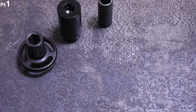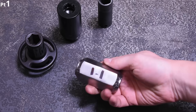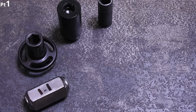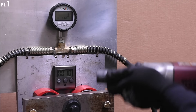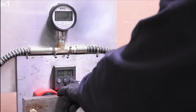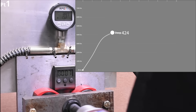Our first homebrew socket, welded together by our friend Ryan, is a long one-inch hex nut that fits over a deep 19mm socket. This costs $6.31 in materials, so it would be a pretty cheap way to hack your impact wrench. Let's see first how a deep impact socket does. Keep in mind this dyno is not calibrated for these dual-size concoction bolts, so we're just keeping things as they are and telling you their score strictly for comparison's sake.